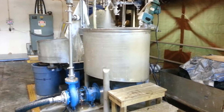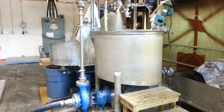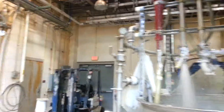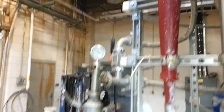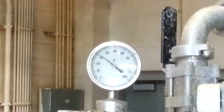We have our feed tank and the blue pump on the left at the bottom is our feed pump. Then we have a feed valve and a feed pressure gauge. Currently the feed valve is set so that we get a feed pressure of about 32 pounds per square inch.